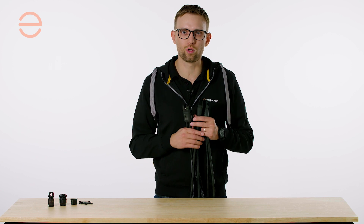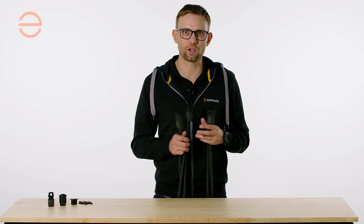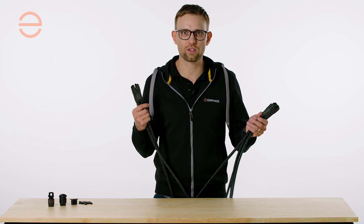The multi phase cable is also available in portrait, landscape, and extra large sizes, and is always connecting to one microinverter. Keep in mind that the first connector might be L1, the second L2, and the third L3, and so forth. As long as you take the iQ cabling from one box, you will always have a phase imbalance with a maximum of one microinverter.